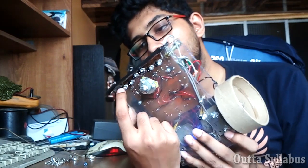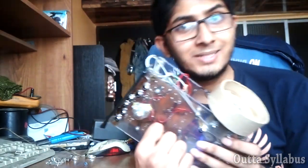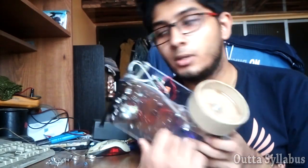I have selected a 6 IR array. You guys know how IR sensors work — there are two pairs, one is the sender and one is the receiver. You can tell by color, or you can use your mobile phone camera, because we cannot detect infrared light with our eyes but cameras can. That's why all cameras, including smartphone cameras, have an IR filter on them.